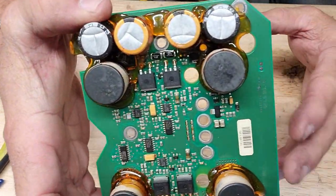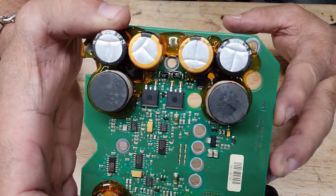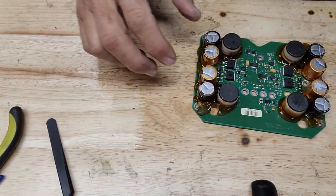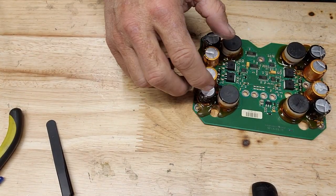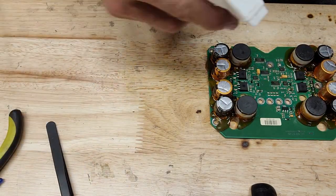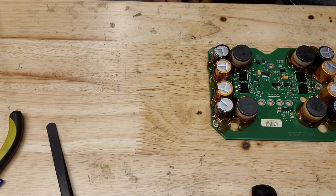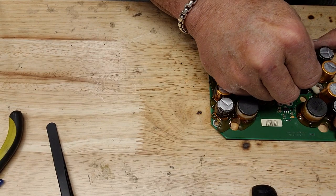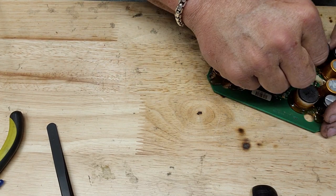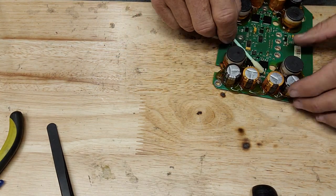It should look a little something like that when you get done. I did bridge to the side, but there's absolutely no difference in the way they work with them bridged or not, so I don't sweat it when they bridge — it's really hard not to bridge them, to be honest. Getting your flux off in here is going to require a lot of Q-tips or something; it's too hard to get a paper towel in there. It's pretty important that you get your flux off — you'll have a nasty mess in six or eight months if you don't.